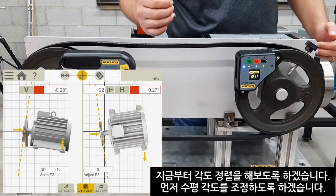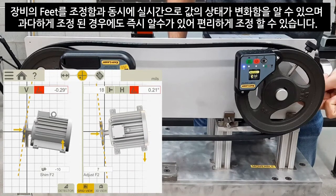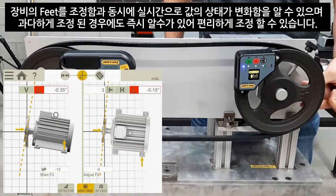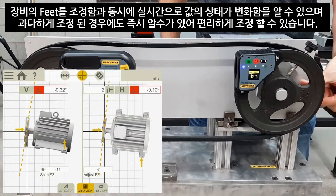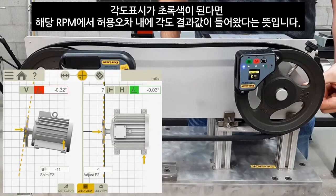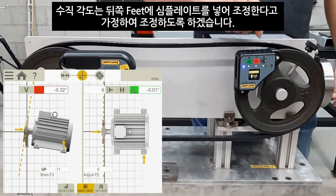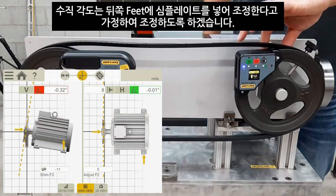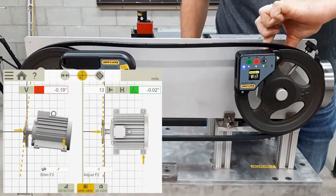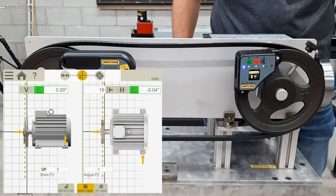To make the corrections I want to start adjusting the angular misalignment, beginning with the horizontal. If I start turning the knob you can see that I'm moving it into alignment — I'll move it past so you can see me going too far, and now I'll come back. This shows we are moving the motor horizontally and making sure we are in the green, which is within tolerance based on the values I entered. In the vertical plane I will simulate putting 10 or 11 thou of shim under the back end of the motor by adjusting the wheel until I reach 0.